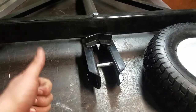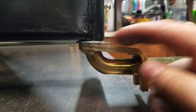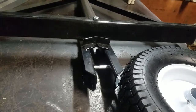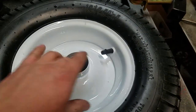A — I was missing the entire hardware bag, so that was a disappointment. B — this spindle, look down here, it's kind of at an angle; they left out the bottom washer. Now obviously there are two washers in it now, but I ended up surface grinding this washer down — it's a hell of a lot thinner. I ground both of them down to half the thickness to get it to fit. Running a fab shop, you kind of expect things, but realistically that's not the biggest problem.